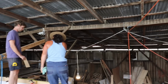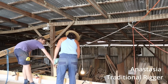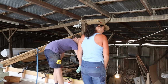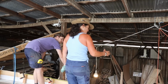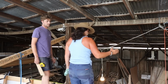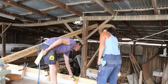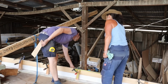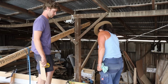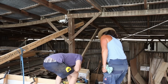But make allowance for the curvature of the hull, so you don't want it to be chafing too much, so you probably need to come back a little bit. Yeah. But I would think about where the chain plates are, where the jib sheets are going to go, that sort of stuff, so they don't get hooked around them. Panama runs out, and that should be an alright line. Okay, but where are your whisker stays? Oh yeah, good point. They're probably right here, I reckon. Yeah. But they're below deck, they're at gunwale height, I've locked them out.